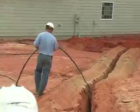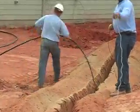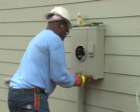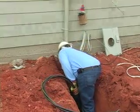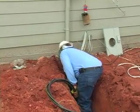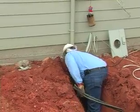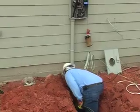The wire is placed in the ditch. Sometimes crews are under contract to bury the phone cable at the side. Thomas is ready to connect the house end of the circuit. He pushes the wire through the conduit installed by the electrician. There are three wires for secondary service from the transformer to the meter: two hot conductors and a neutral, providing both 120 and 240 volts inside.